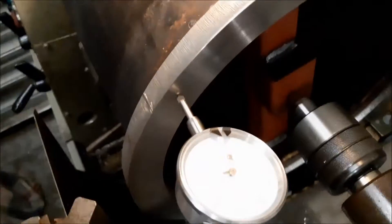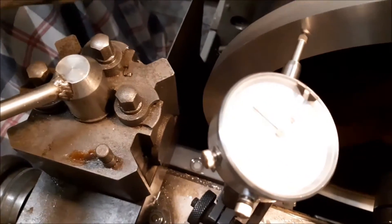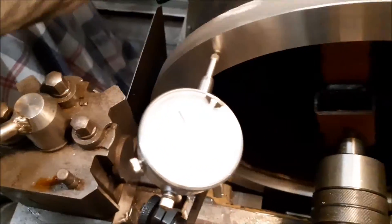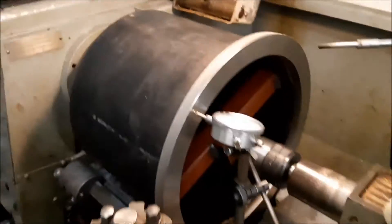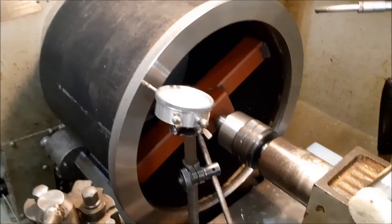I've put the original piece back in - it's difficult to see. It's pretty near flat, as much as I can get it - within 10 thousandths anyway. I'll have to do another skimming pass before we can put the o-ring groove in.